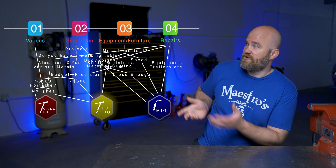I hope this video gave you some kind of direction on where you might want to head when purchasing your first welding machine. When I was making the decision for myself, I already had TIG welding experience, I wanted to do some aluminum and steel, I was working out of my garage, and I wanted to switch quickly — that led me towards getting a used AC-DC TIG welding machine. I'll leave links below to the manufacturers I work with. The whole time I had that TIG machine though, I was waiting until I could finally afford a MIG welder, because the last thing I wanted to do was build a big steel table and TIG weld the whole thing — it would just take forever. Both processes have their advantages and disadvantages for sure. Hopefully this video simplified it for you.